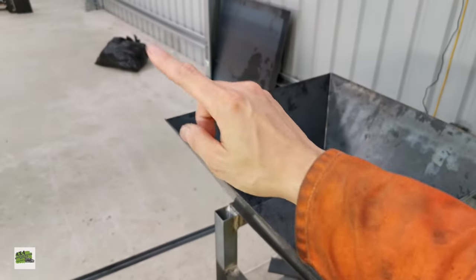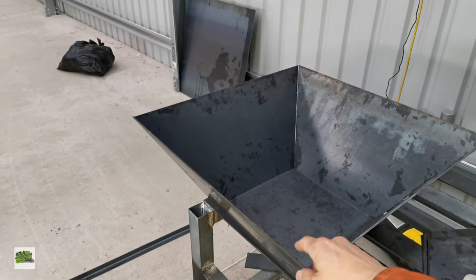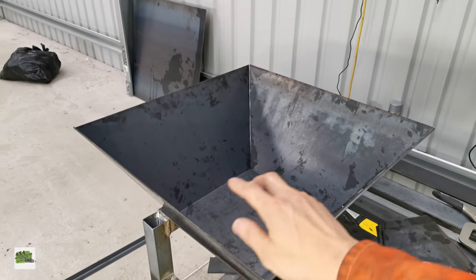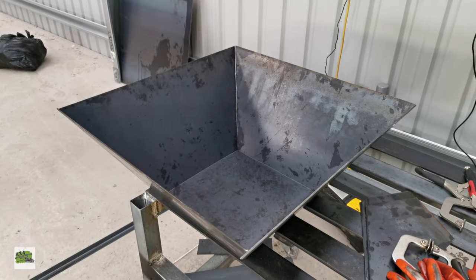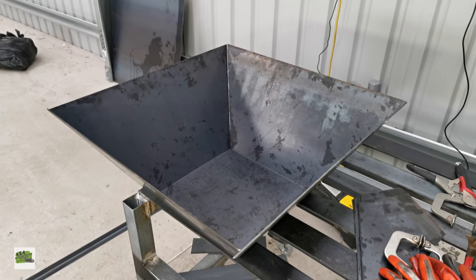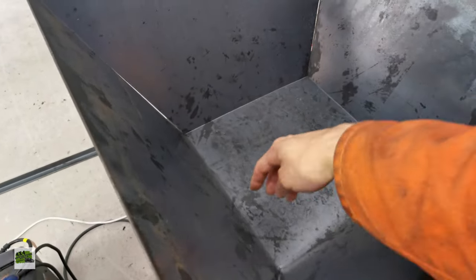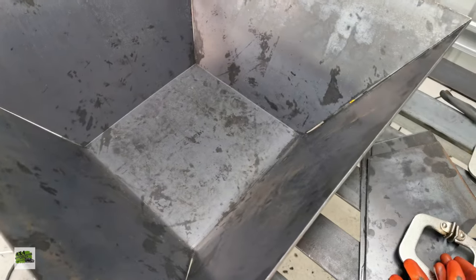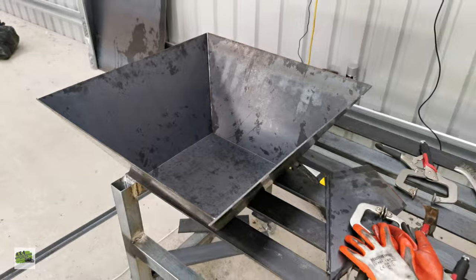You put something a little bit longer, and make sure you have clamped something strong on either side. And then you find something to stabilize the top, and then you pull it up. That's probably the easiest way to bend a thick piece of metal. But obviously, that way, if you really want to have a strong structure, you might have to put some weld in to strengthen the joint. Otherwise, you might have to use a hydraulic bender.